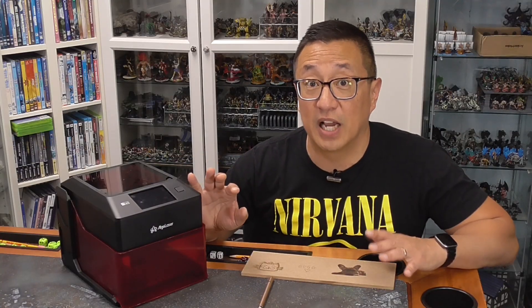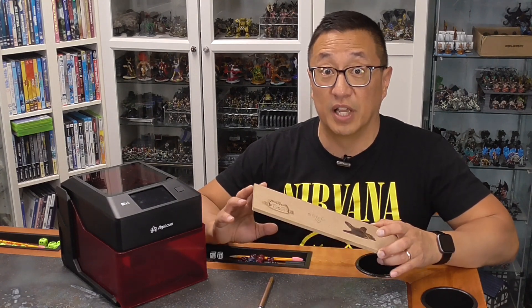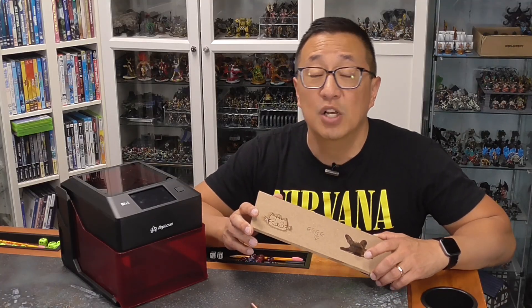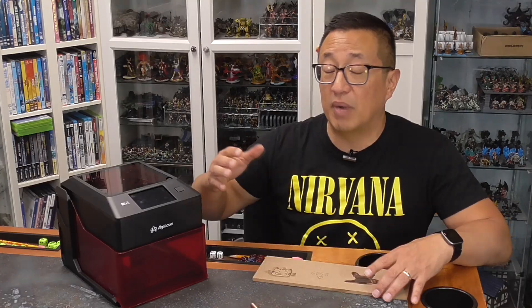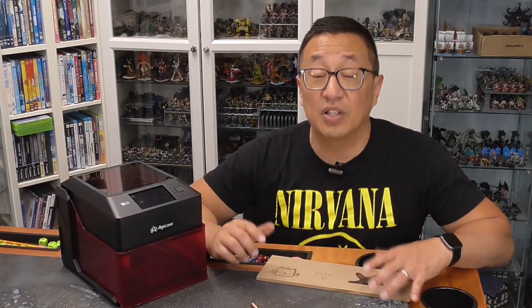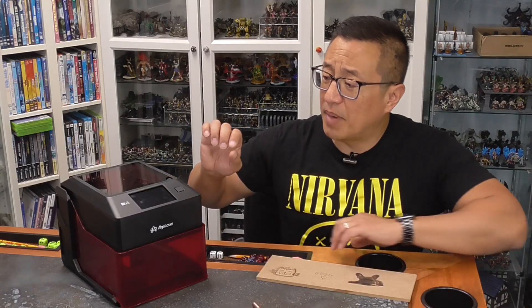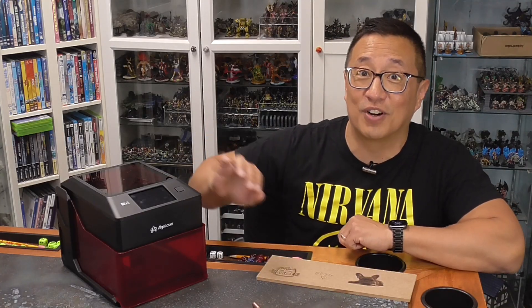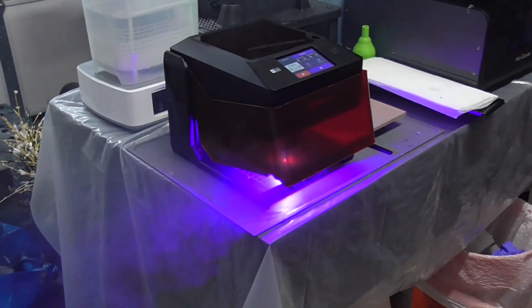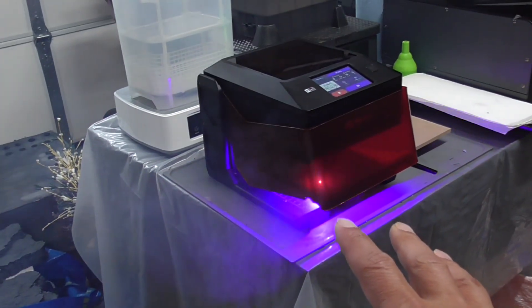Although I do all of my lasering outside because you get a powerful burn smell from whatever stock or material that you're doing. Especially if you are lasering in acrylic or anything plastic, those fumes are toxic. My recommendation overall is to do these outdoors where you have plenty of ventilation, unless you have a really good system indoors to vent those fumes out. Also you have to remember that looking at a laser beam will hurt your eyes, so it does come with protective glasses. But you do additionally have these protective covers here that's going to prevent you from burning your eyes by looking at the laser.